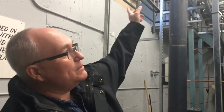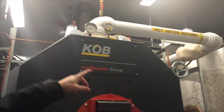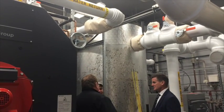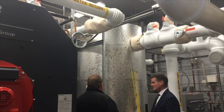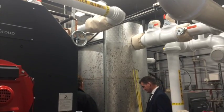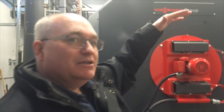Because you can't shut off a wood fire — you can't turn it off like an oil appliance — what happens is there's a pump that pumps all of the hot water the boiler has made into a storage tank. There's a 1500 liter storage tank. It's got sensors — three sensors in the tank — and it's reading the temperatures as it's filling up with hot water. As it gets close to the set point at the top, it starts to turn the boiler down so it doesn't overheat.